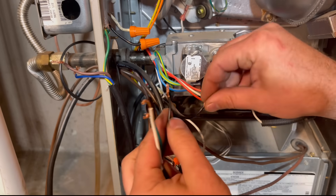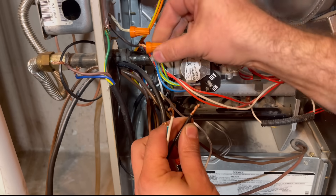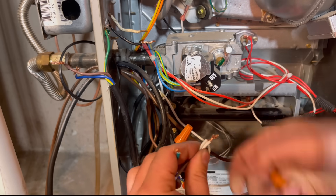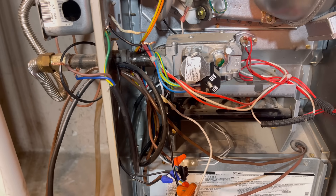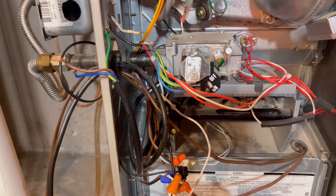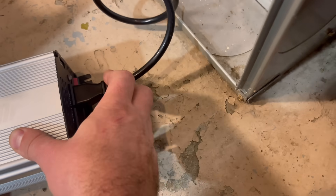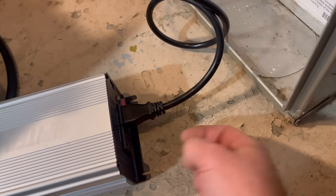I'll show you just how simple this is to wire up. We're going to take our black lead and wrap it to the black here. And we're going to take our white and hook it up to white. Now my particular furnace actually doesn't have a ground in here, so I'm not going to worry about that part of it — just black to black, white to white. So we're going to plug our inverter in right here. The cool thing about it is we actually have another plug, so if you need to charge something or power a lamp to have the lights on, you can also plug that in as well. So we're going to go ahead and flip this switch on.